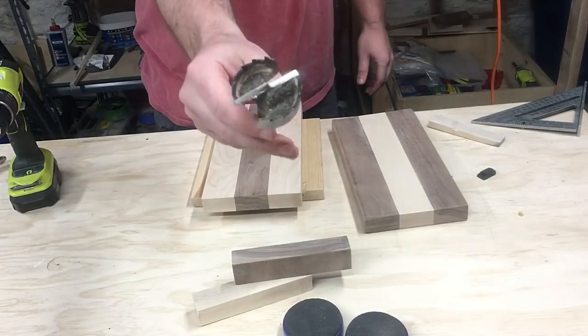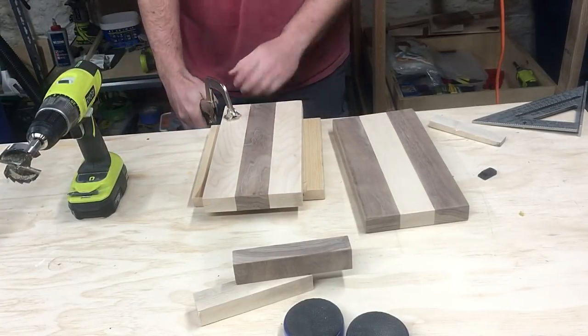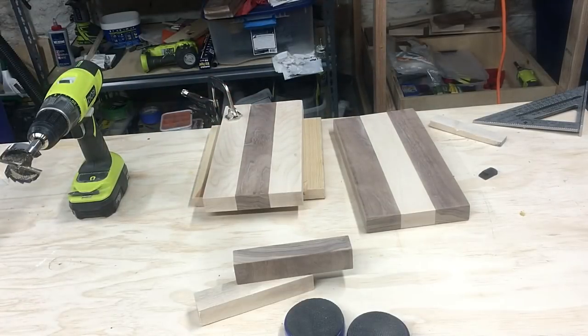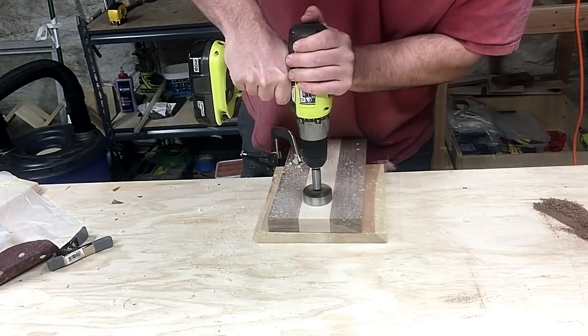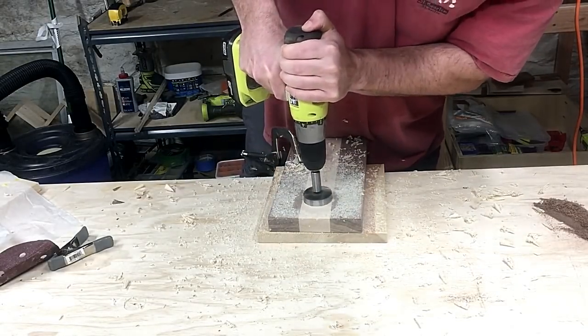For making the holes, I used a 2-inch Forstner bit. A regulation cornhole board has 6-inch diameter holes, so to maintain scale, I should have used a 1.5-inch Forstner bit. However, making beanbags so small would have been difficult, so I went with a 2-inch hole.